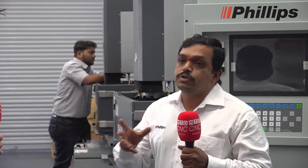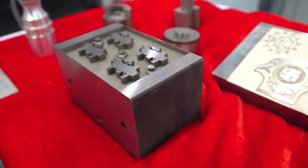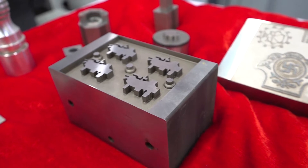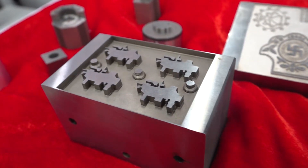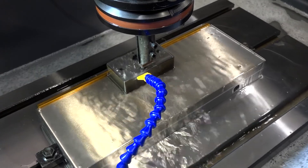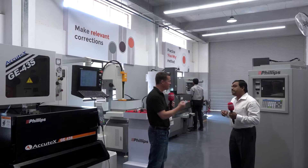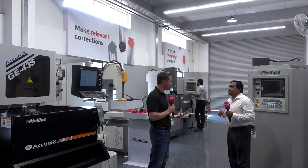In other machines, some products are going to be finished up to 80 or 90 percent, but they will not be 100 percent without the use of EDM, especially in plastic moldings. For example, if you've done some molds on a VMC, there will be cutter marks and cutter radius in the corners - it cannot be totally sharp. If you want a totally sharp corner, you should use electrodes and make it sharp by die-sinking. So through EDM, we're adding real precision and achieving angles we can't reach on other machines.